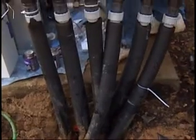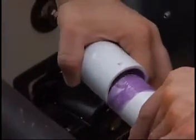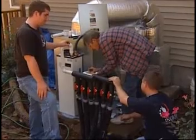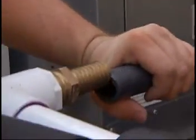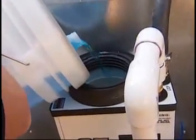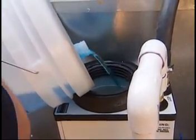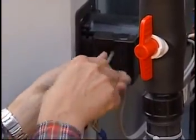The second step is filling the pipe with water and connecting to the header manifold. This is a non-pressurized system, which makes it different than conventional geothermal pressurized systems. Now it's time to hook the supply and return to the unit and the QT flow center, and adding the propylene glycol. You'll need to kick the power on and start the pump, adding water or glycol to the flow center, then hooking the power from the QT flow center to the contactor on the unit.